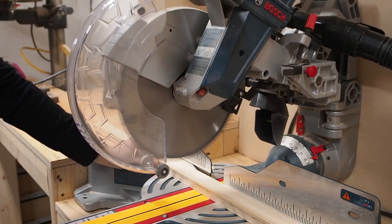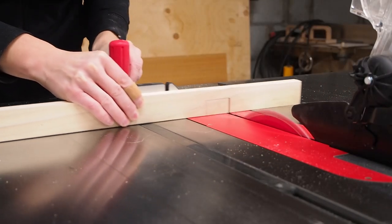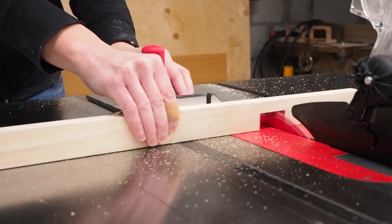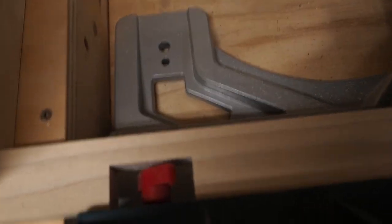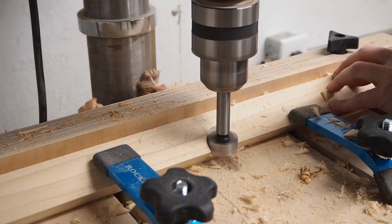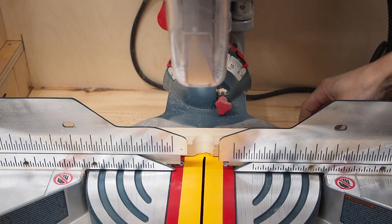With the box built, I'm now going to add some rails for the sliding doors using a simple 1x2. I need to cut out two slots to make room for the knobs at the back of the fence. I position the rail flush up against the back of my fence — the rail is being supported by my workbench on each side and on the saw's base in the middle. The only issue is that the blade will hit the rail, so I mark that and make a little cutout. I set the rail on an angle and clamped it down so I can use a Forstner bit to make an angled cutout, then pop it back into place and check the fit.